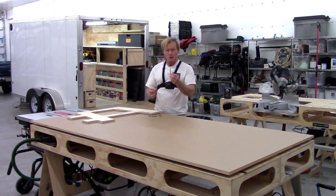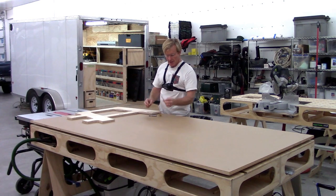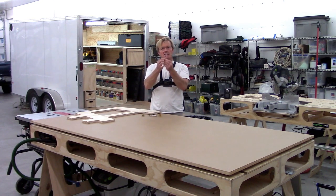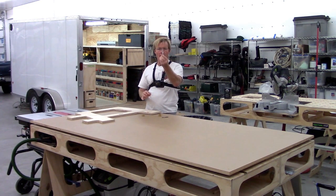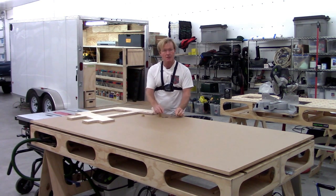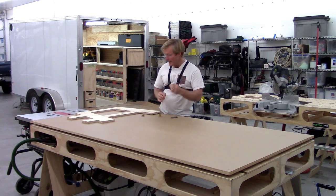What I'm going to try to do is use a quarter inch cutter for this. Now, they're not quite as stable — obviously they're smaller, quarter inch all the way through — and so they will have a little bit more vibration in them. Also, they can break if you're pushing them too much. I prefer to use the half inch cutter, and I may end up going to that if this doesn't work out or if I break it.